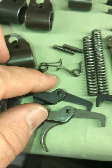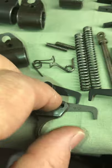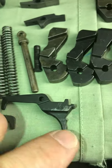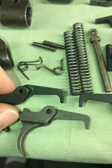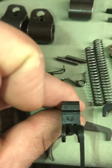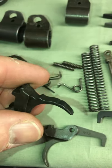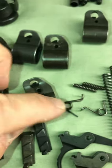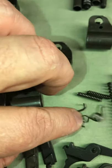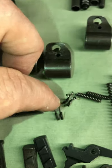Triggers: all I've ever seen was a type 2 trigger. Most of them are marked in here or possibly on the left-hand side. Rock-Ola triggers are marked on both sides of the arms, and Grand Rapids are marked on the top. They also might have a notch in the back of the trigger. Two types of trigger springs — this is the generic one, used to replace any of the earlier ones.